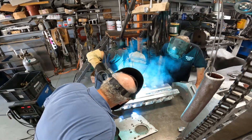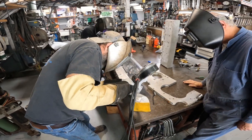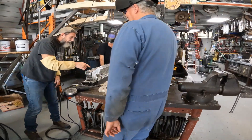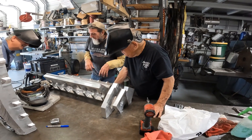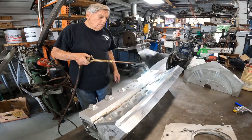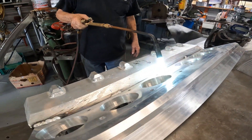This first step is crucial as Eric determines the correct parameters based on the thickness of the material as he lays down the initial tack welds. There was a lot of cracking and spraying, so he's trying to find the happy medium. It is determined that the block components will need to be preheated to achieve optimal weld quality and ensure that the integrity of the engine block is not compromised.